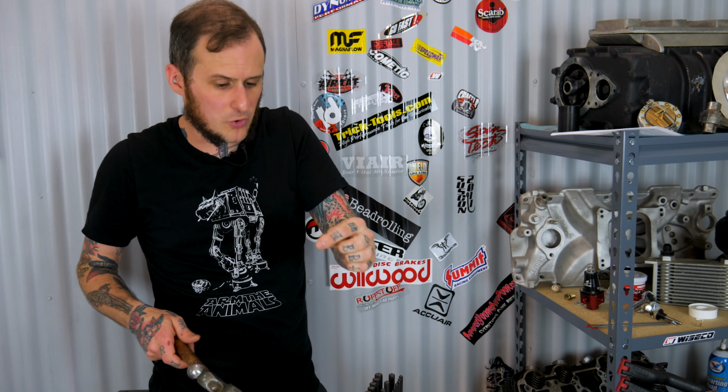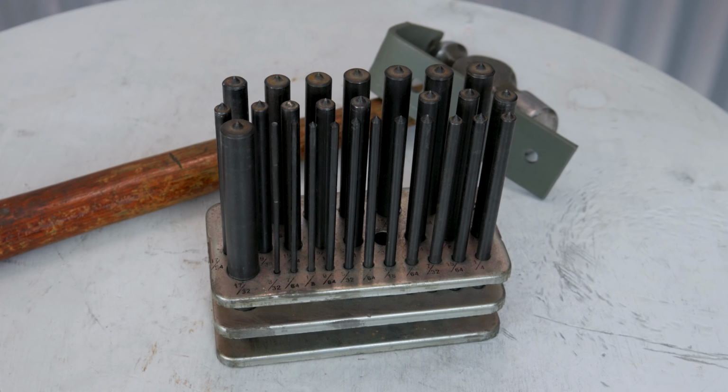Now, one problem I have seen with other people's transfer punches, especially the smaller diameter ones over the years, is they'll often get a bend in them. Because of course you have a nice long piece you're sticking through that hole to transfer that punch. Well, what happens is folks hammer too zealously on it, and they bend it as they hammer it. You do not need to hammer heavily hard with these. Just a simple little light strike with a hammer generally transfers the point. Or I've known folks who just use the point and scribe with it. They just put it down through the hole and spin the transfer punch to use it more as a scribe than as an actual full-on punch.